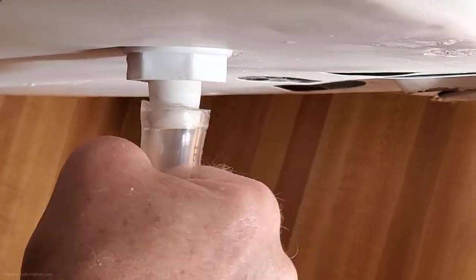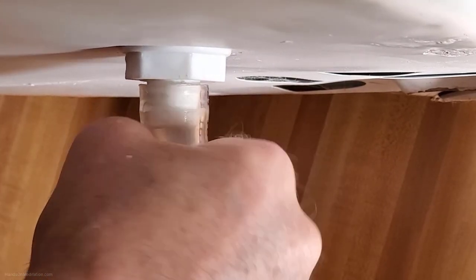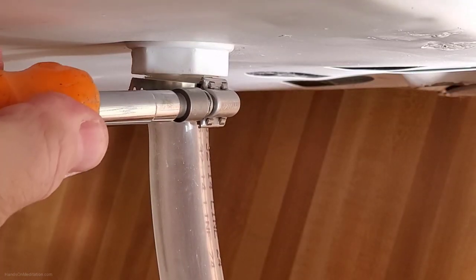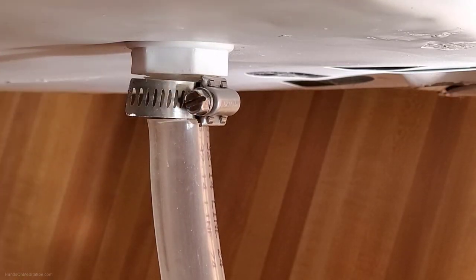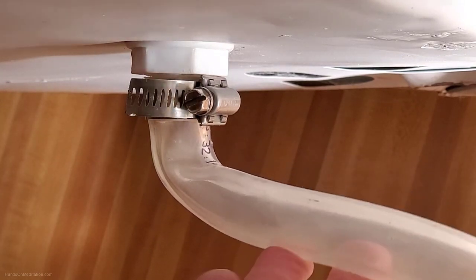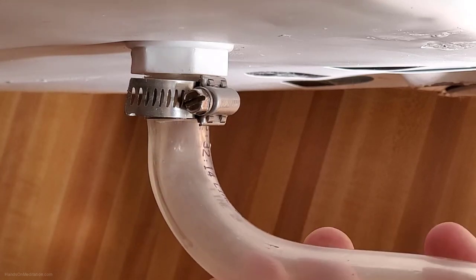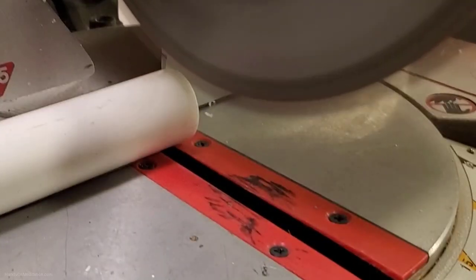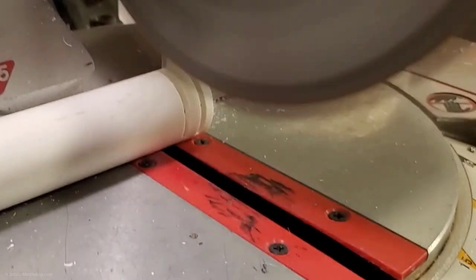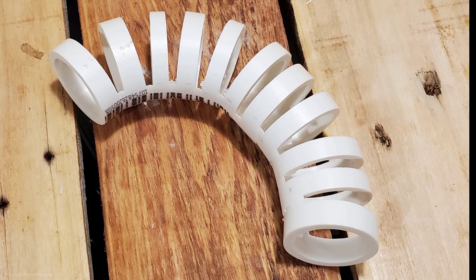Attach a water hose to each through hole. You can soften up the tip of the hose in hot water if it won't stretch. Then secure it with a hose clamp. Be careful not to pinch the hose by bending it too quickly. You can keep a gradual bend in the tubing by raising the cold plunge higher off the floor — I sit mine on 2x4s. Here's a simple hack to keep the hose from collapsing around a bend: take a scrap piece of PVC pipe, cut a series of partial slits, bend the PVC into a supportive arch, and hold it into place with a hose clamp.